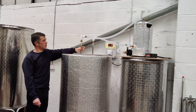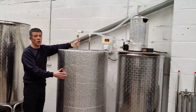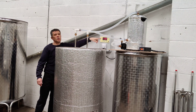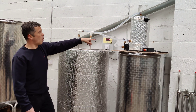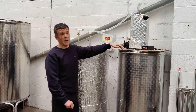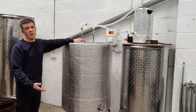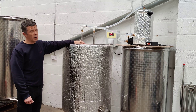Over the period of the next few minutes or hours even, the temperature inside the fermenter will start to increase until it gets up to 30 degrees, at which point the control panel will switch the pump off and no further action will be needed. The hot water cylinder is quite a low consumption unit, and it will just sit there. The advantage really is that you can control in an upwards direction the temperature in your fermenter, without using the aggressive heat source that an immersion element would be in things like hot liquor tanks.